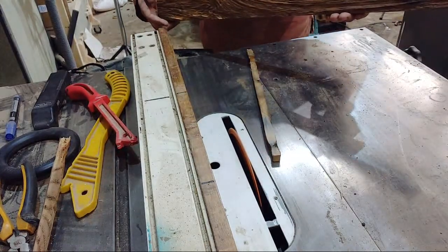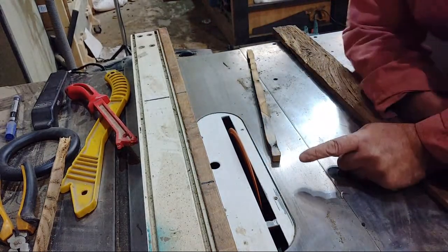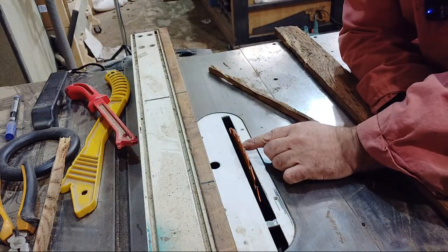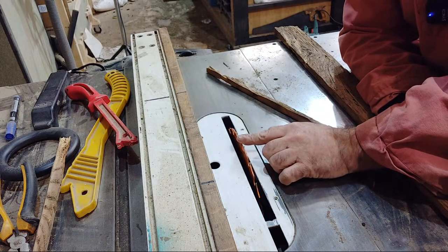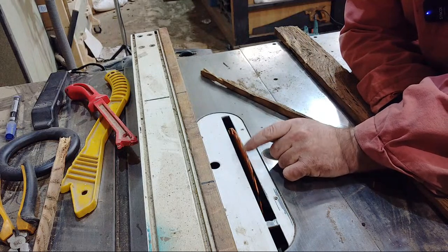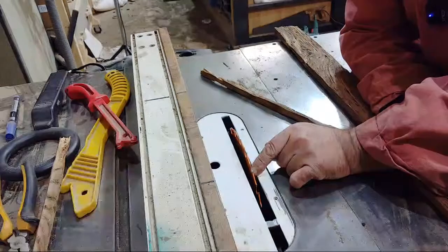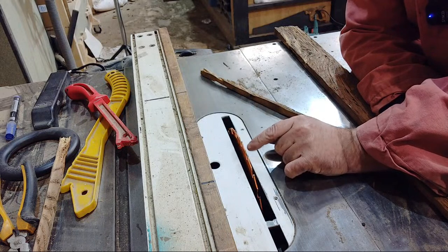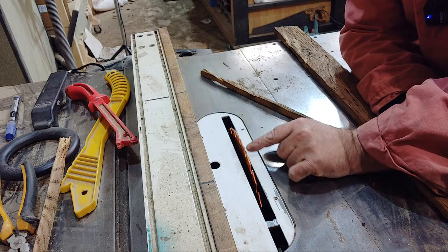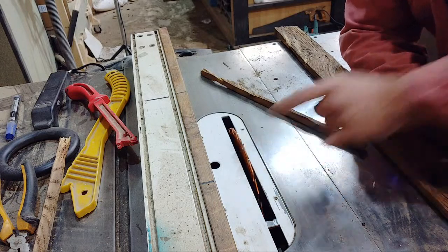In case you're wondering, you probably aren't, but you have two options with your blades: you send them to the saw doctor, or you sharpen them yourself. If you're capable of doing it, you can sharpen yourself. What I tend to do is about 10 sharpens myself, and if the blade still has all its teeth, I then send it to the saw doctor, and they'll do a proper grind, where every single tooth is exactly the same. Because eventually, no matter what you use, and I do have a machine for it, it's not that accurate, but it does do a good job. The only thing is, eventually one tooth will be lower than the rest, so it's not really doing its job, and it's best to get it re-ground properly. They do a really good job, if the blade's worth it.